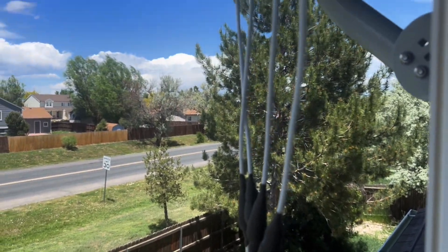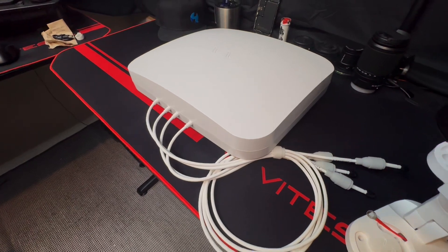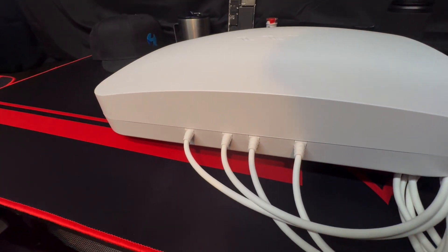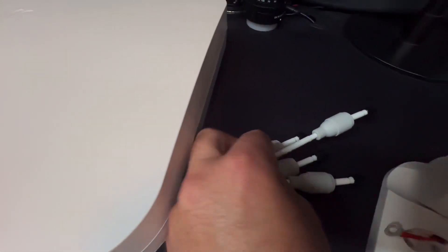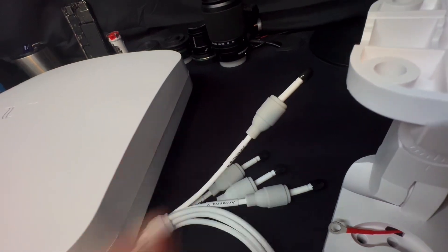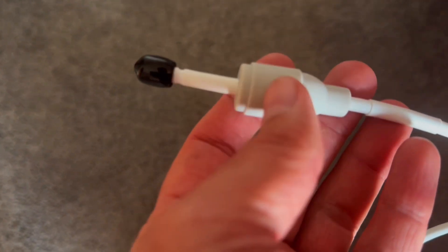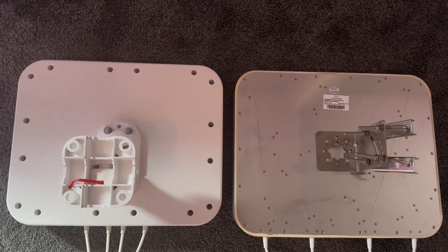What's really nice about the new one is the redesign on the Quad Pro doesn't have those stickers. They've relocated the labeling to the actual cable itself, so now it says antenna 1 through 4 printed directly on the cable. They've also switched from an N-Port to an SMA port, which is a lot smaller and just a nicer quality. They've also added grommets or boots to the cable, so after you make your connections you just slide the boot down over the SMA connection — it's waterproof and you're good to go.